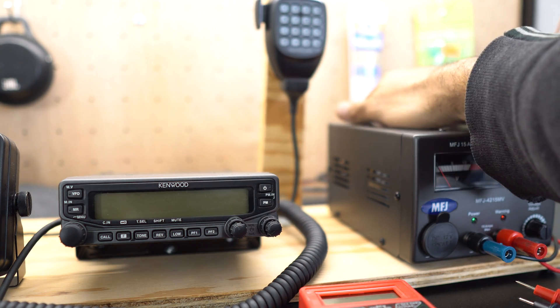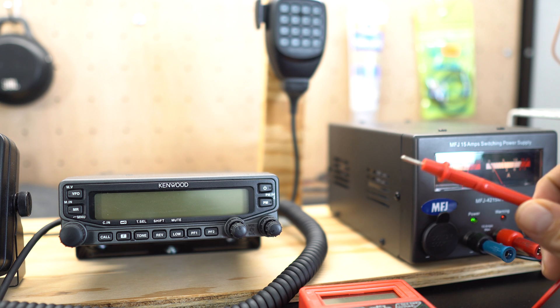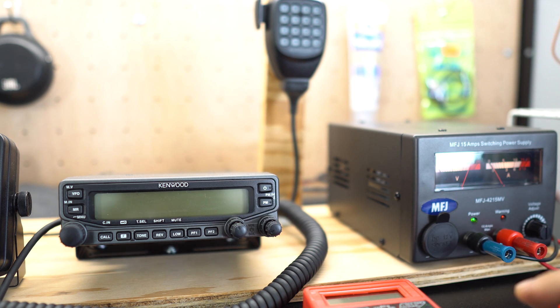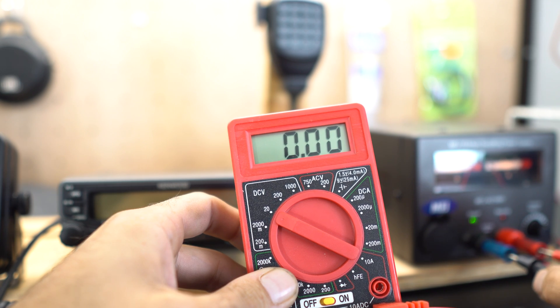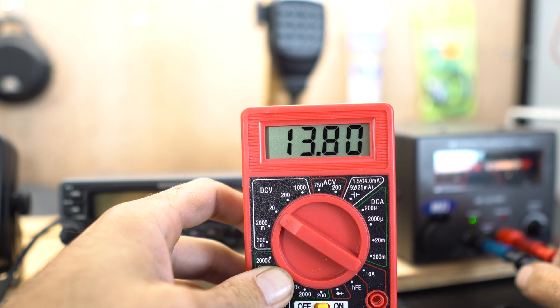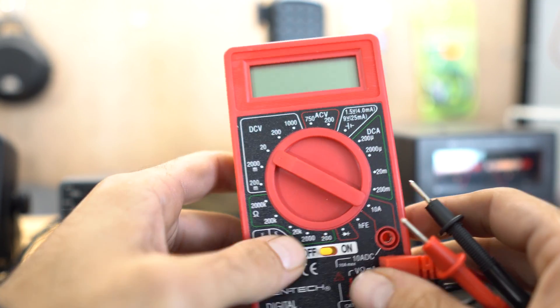Let's fire up the power supply. Over here, right in between 10 and 15 volts, there's a small mark — a little red dot — and that red dot is exactly at 13.8 volts, because they know you're going to be running this type of radio. If you're running a mobile radio at a base station setup, you're going to want to run it at 13.8 volts. What I like to do is get a multimeter and verify that your power supply is indeed putting out what it says, and not just go by the built-in voltmeter. As you can see here, it's 13.8, pretty stable at 13.8. Now that we've verified the proper voltage, we can turn on the radio.